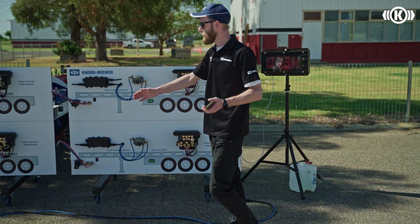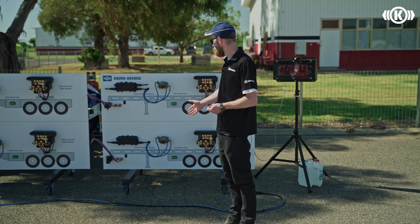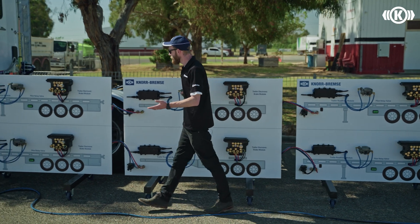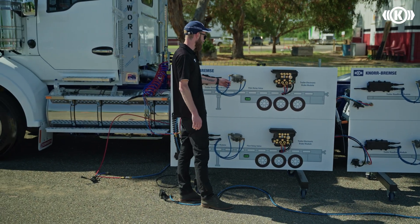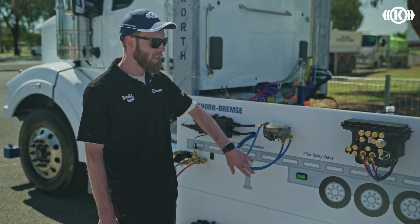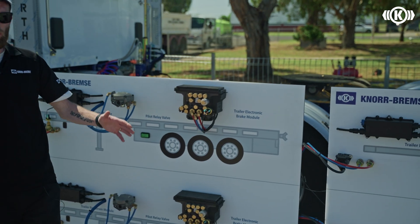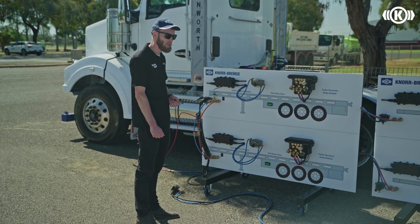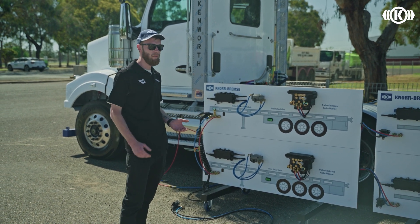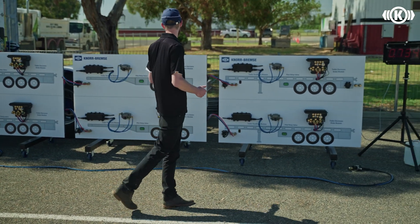The next test resembles what a light brake application will do, showing the effects of crack pressures in a combination. Each of these relay valves has a crack pressure inside — that's the pressure it takes for the control signal to overcome any mechanical or spring force within the valve before it outputs a pressure signal to the TEBs and to the rear trailers. If there's a crack pressure in the second and third valves, they compound together causing delays down the bottom. So under light braking — if you're just trying to wipe off a couple of kilometres to come back to the speed limit — the driver makes a light brake pedal application. We'll mimic that on the boards and show the difference between CAN and pneumatic.